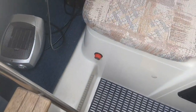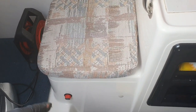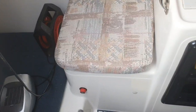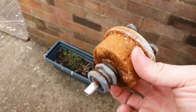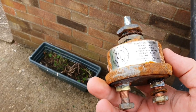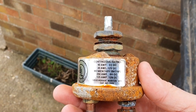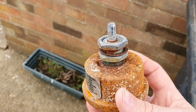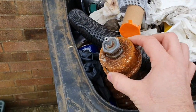We'll just turn the cabin lights back off. Good, all done. The other thing just to mention - on the other side of this I put a load of Vaseline all around the terminals once I connected them, just to try and protect it a bit, because obviously it's in the bilge area and it can get a bit damp under there. That's the old internal kill switch - that's probably been in there since it was made in 2002. You can see it's rated at 20 amp continuous and 40 amp as well - so actually the smaller one we're putting in is a far upgrade to this. So that can go in a bin.